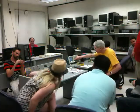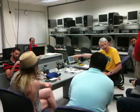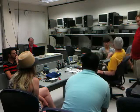Does it look shifted? Yeah. See, now it's at its maximum where the other has 0 degrees. So it must be about a 90 degrees phase shift. That's what it looks like. So the angle has been shifted. Instead of rising right here in the center, it's rising earlier. The current is leading the voltage. I think we have a reasonable piece of equipment here for measuring the angle.